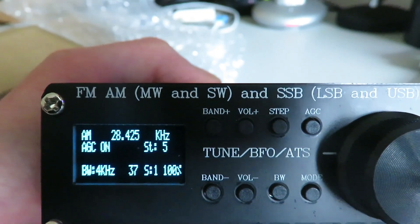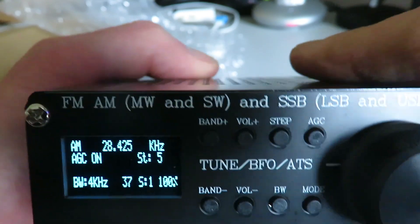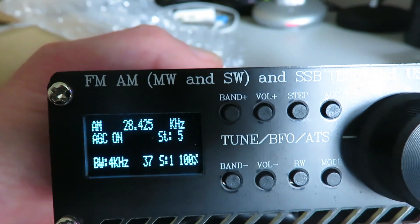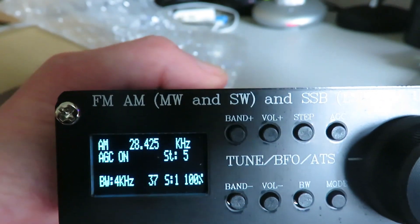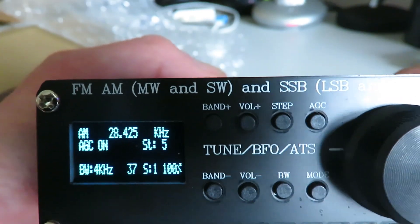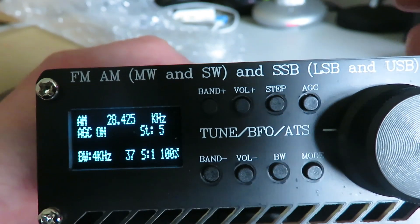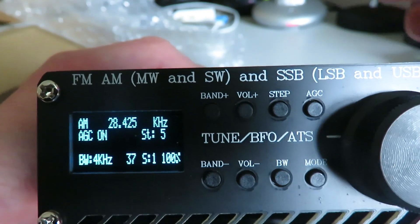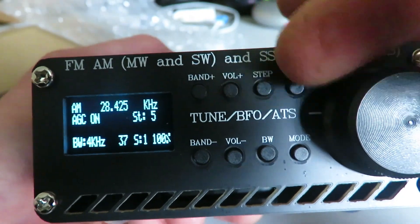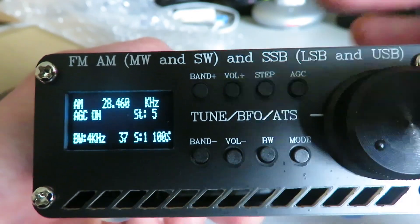You can't do this with these. This needs to be used normally — not abused in any way, but used as a receiver, used with the various modes, using the encoder wheel — to see whether it's going to exhibit the same problems as the other radio did. At least it's clear I haven't got the bridge pins issue on this one. My mode button is working and my encoder is working, so let's see how long it lasts.